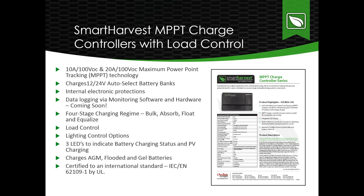A key feature is load control: because DC loads connect directly to these charge controllers, they include additional protections. If the controller detects the battery bank is reaching low voltage, it cuts the load and directs all PV energy to charge the battery — that's low voltage disconnect. There's also high voltage disconnect to protect the load if high voltage is detected, and overcurrent protection that cuts load charging if high current is seen. Three LEDs indicate battery charging status and whether solar is present.